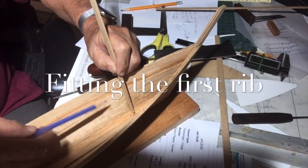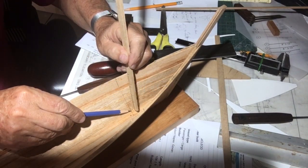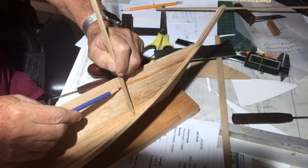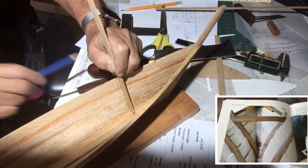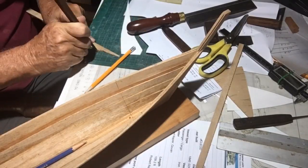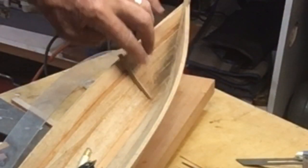As you can see, you're going to need quite wide ribs to start off to do the carving. We've cut a little slot — a recess — to accept the rib, marked it off with a paper template, and now we're going to cut them, first with a saw and then with the chisels. There's no question the first one is the hardest.